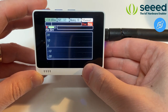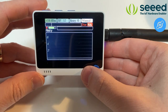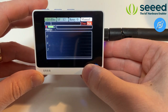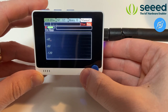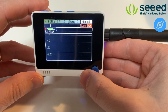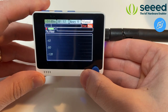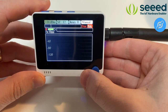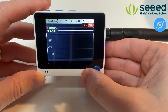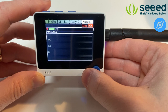We can see the number of retries depending on the retry setup — currently we have no retry so it won't display much. More interesting is the TX RSSI, which is something you get back from the network. When the device sends a message, it is analyzed on the backend, and as a response the device receives the signal strength as seen by the Helium network.